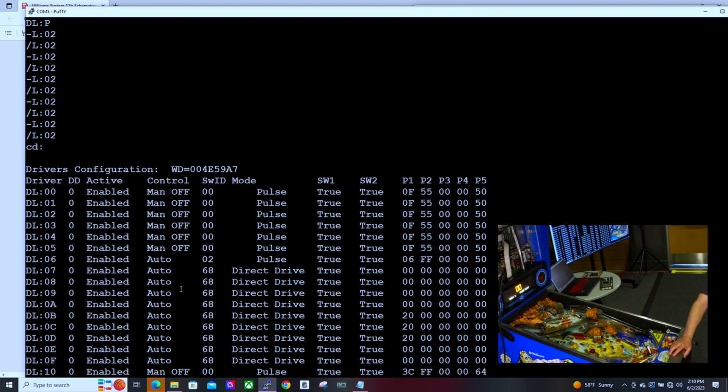They're not really analog. By nature of how much power a lot of coils take, you want to be in and out relatively quickly. You don't want it running in the analog range because the final drive will be taking the brunt of all that current and likely destroy itself. When doing PWM, the shape of the waveform matters — when we make our own hardware, if you go too sharp you throw out a lot of EMI; if you go too slow, you cause a lot of heat in the final drive.